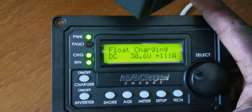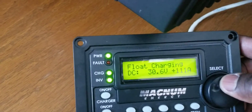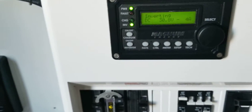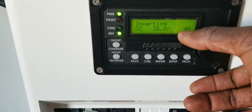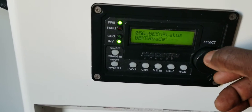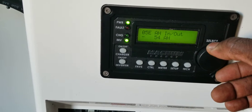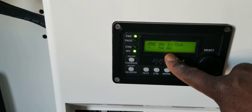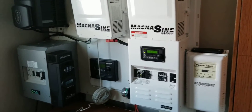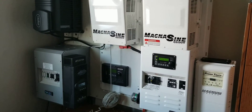You can only see on the main screen. It's putting out 111 amps — that's all it knows. Our test is successful and we're ramping up the power. The BMK here is just telling us it's pulling something currently but it doesn't know where the power is coming from, though it can read on the other side. This amp hour is going to be dropping — this is what we already took from the batteries and we're replacing it back with the 240 configuration. That's what we're doing right now at JW Solar USA.